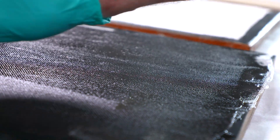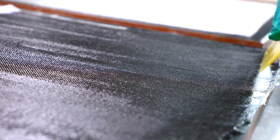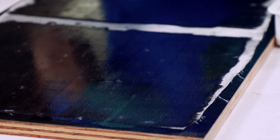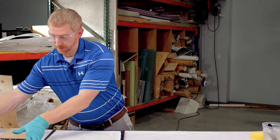I'll take a flexible plastic spreader and run it over the surface at a low angle. If we're close to room temperature — around 70 degrees Fahrenheit — we'll wait about two to three hours, let it get like a soft rubber initial cure, then come back, mix a new batch of epoxy, roll on a nice even coat, and gradually build up the coats. I'll move this panel out of the way and we can take a look at what we have over here.